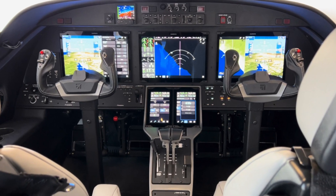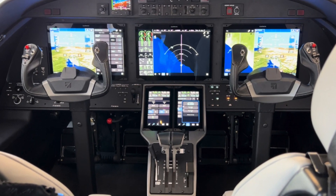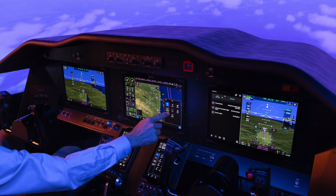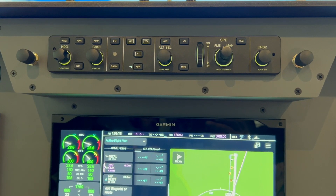What is the typical configuration of a G3000 Prime — does it vary by airframe? The configuration for G3000 Prime is primarily three primary display units with two secondary display units. There are configurations for the advanced air mobility market that use a different setup, but this is the primary G3000 Prime installation for the Part 23 market. Flight control autopilot still has a control panel up at the top of the glare shield, and that's not going to change anytime soon in this category of airplane.